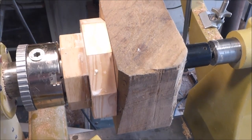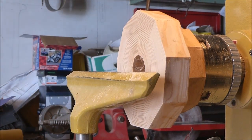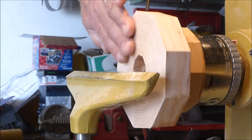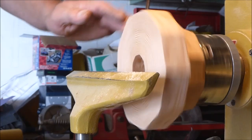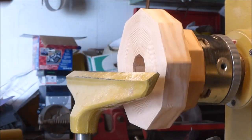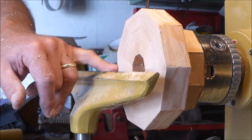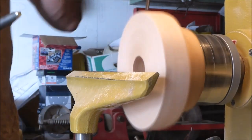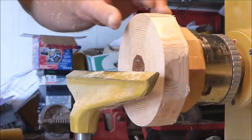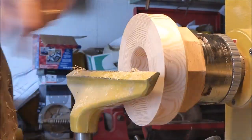It's a warm day today so it should dry relatively quickly. It's been a few hours now and the glue feels like it's holding really well. I've surfaced this face off and now — because I'm about a tiny bit out of center, not necessarily here but on the outer edges — I'm going to take the time to hollow out a little to show me exactly where center is, and square off or round off the outer edges. I'm removing excess material with my 5/8 P&N bowl gouge, truing this piece up outside and inside.